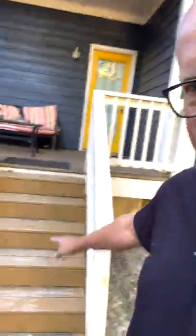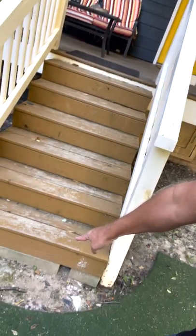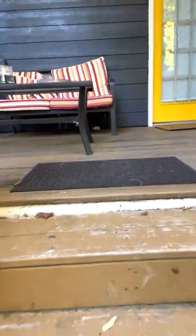There's also a deck on the rear of the house — a small deck — so I'll take a look using the same procedures, starting from underneath. What I noticed while walking the stairs is that the step at the very top is different from the rest. The bottom step is very high, and this one's very short. I'll take a measurement of each, but that's a bit of a trip hazard.